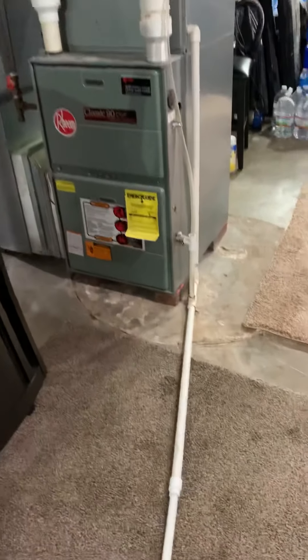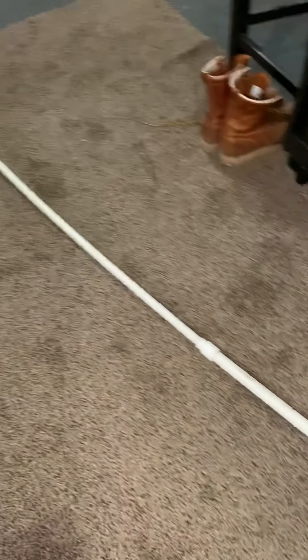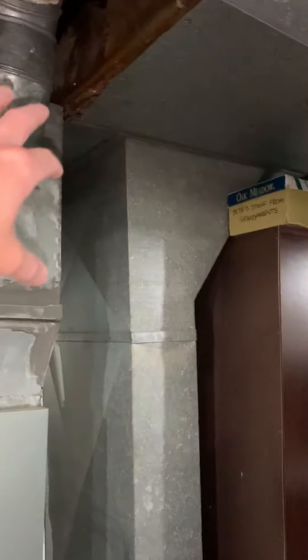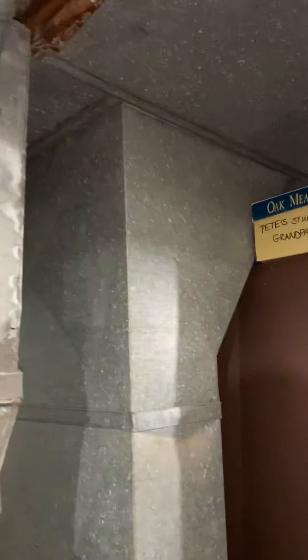The PVC drain goes straight over there — they're fine with it the way it is, so we'll just hook back up to the PVC. New media humidifier going in. We're going to rework the return duct because it's not picking up all the way, so we'll make a box that gets mounted to the ceiling and come out of the bottom of that box for a return.